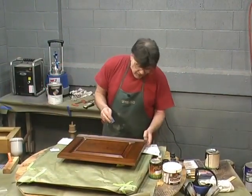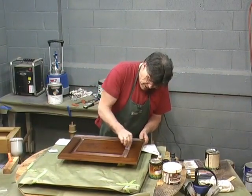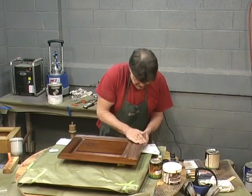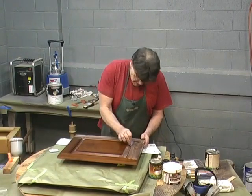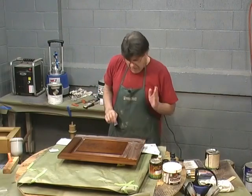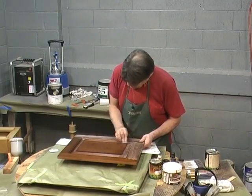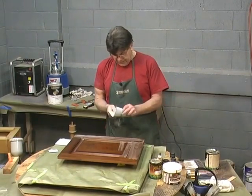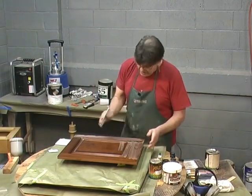Now again, we don't have a whole lot of finish on here, so all I'm doing is just kind of wiping, kind of just knocking the fuzzies off. I think Bob Flexner in his book called it de-whiskering. That's a pretty good analogy. But I'm gonna tell you up front, you guys, I know you're gonna get on here. Now here's another piece of 320 stearate mid-coat sanding.